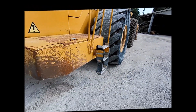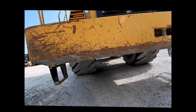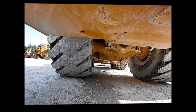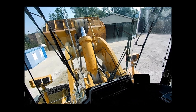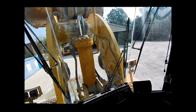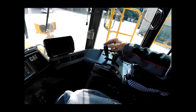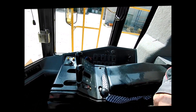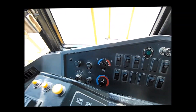Tire condition is checked and tires are measured — a visual inspection alone is not sufficient for a machine of this size. Leaks on the transmission and axles are noted. The inspector records cycle times for boom lift and bucket in/out, checks whether the automatic bucket kick-out is working, and records the machine hours to confirm the hour meter is functioning.